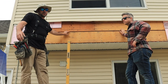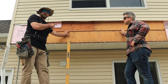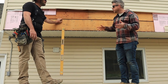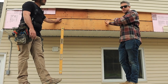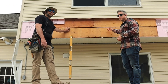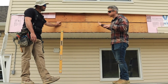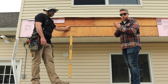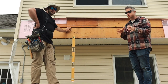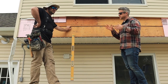Step one is checking with the homeowners so we can go inside and see where the floor is. This is technically going to be a free-standing, self-supported structure because of the cantilever on the second floor — you can't structurally attach something to bear load there since it's already cantilevering past that wall. We are going to attach a ledger board to start straight, but it'll be packed out to a triple 2x10, and there will be posts going directly down to our helical piles. So it will be self-supported, but the attachment to the house helps with sway and makes it easier to get started.